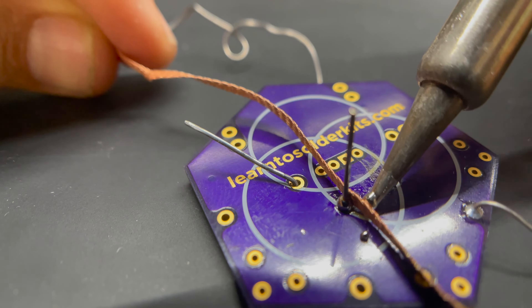The key thing is it's hard to get enough heat transfer. What you can do is bring a little bit of solder onto the side to get thermal linkage, and then you should see enough heat transfer so that you can get the rest of that solder ball to melt. It takes a little bit of finesse — keep working at it, removing solder bit by bit. You can keep going through the process until you remove enough solder so that you can once again see that concave shape. Remember, it's always easier to add solder than to take away solder.